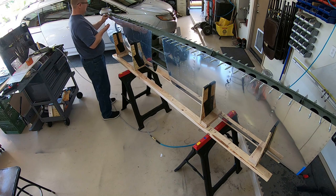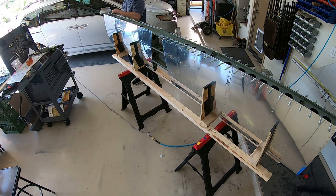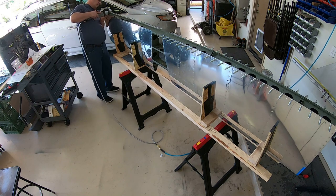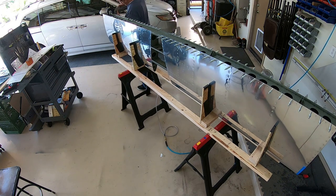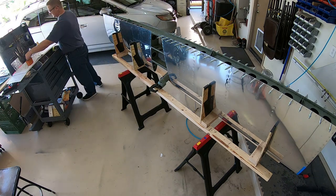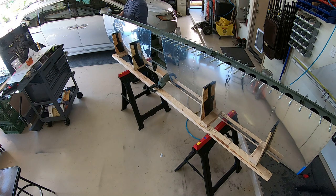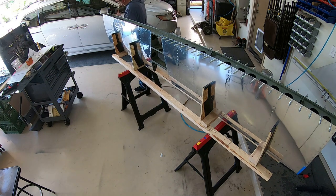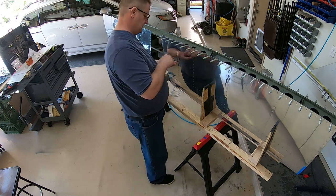Squeeze all those. You will see that I make a mistake — well, it's not really a mistake, but the squeezer itself: when you have the adjustable head on the squeezer, as it goes it gets loosened up and it will turn and have more space, so you have to keep putting it back every 20th rivet or something like that. It's not very noticeable but it does happen, and when you're doing hundreds of them through the day it'll loosen up enough to actually make a difference. You'll see me get done with this side and then maybe part of the right side before I realize hey, those don't look like they're squeezing as far as they should, and I grab the measuring gauge and check where the last good rivet was.